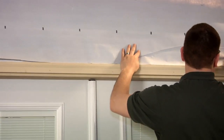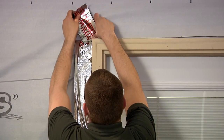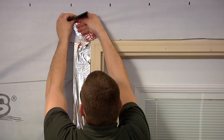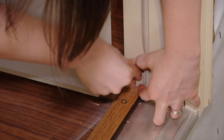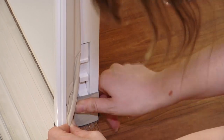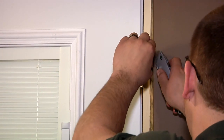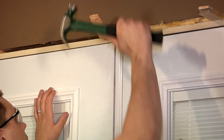Fold the water barrier over the flashing tape. Cut two pieces of flashing tape at least one inch longer than the diagonal cuts in the barrier and apply them over the cuts. Make sure the corner seals are in place — there will be one seal per hinge jamb and one that needs to be applied to the astragal. Remove all excess shimming material by first scoring the shims and then breaking them off with a hammer. Add casing to the unit as desired.